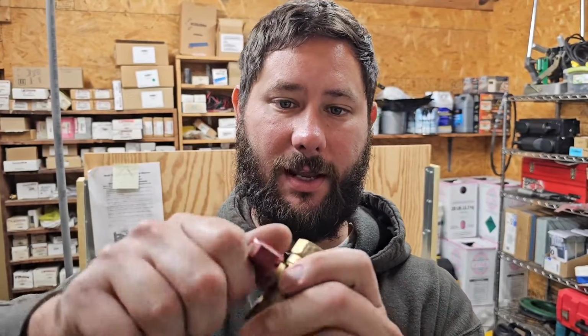If your gas logs are not lighting at all, it could be that you need to bleed the air out of the line. Every year, a lot of homeowners shut their gas off, and usually their shut off is outside of their gas logs. And when they shut their gas off, then their pilot tube, which is a very skinny tube that leads from this valve to this assembly, becomes filled with air. So you have to bleed all the air out of that pilot tube and assembly before you can actually get your flame to light. So if you're having trouble with your gas logs and it's not lighting at all, you may need to hold down your pilot button for quite a while until you can make sure that you've bled all the air out of the line, and then it will light.